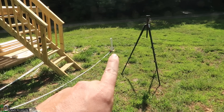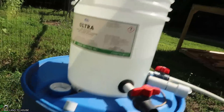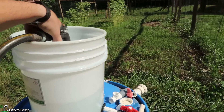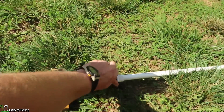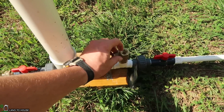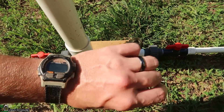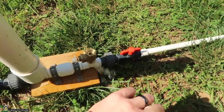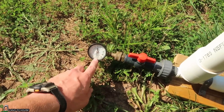To run this test, I have the pump on a 20-foot drive pipe with approximately three feet of head pressure, using a bucket as a source. I'm filling it up with water. For the first test, I have the pump empty. I'm going to open up the drive pipe, push this until it starts, and time it for one minute. Okay, here we go — one minute.